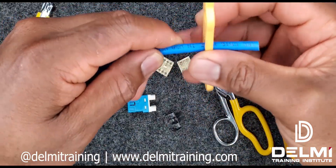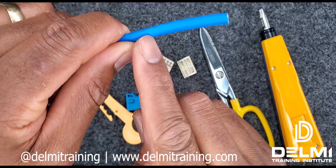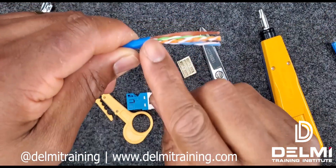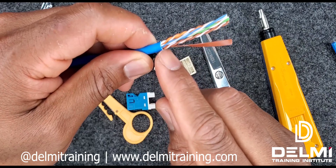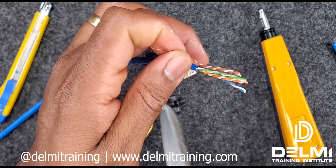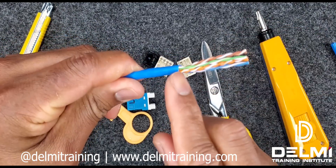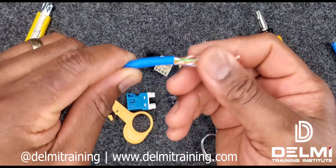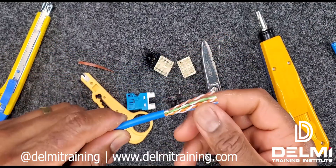To get started, I'm going to use my cable stripper, run it through, pinch it a little bit, and twist it — that scores the cable a little bit — then wiggle it and take the jacket off. Every time I strip this cable I want to be extra sure I did not end up scoring the sheathing of the actual cable and damaging it. If that happens you may notice the cable falls apart partway through termination, so always check. Strip about an inch and a half off your jacket and separate your cables.